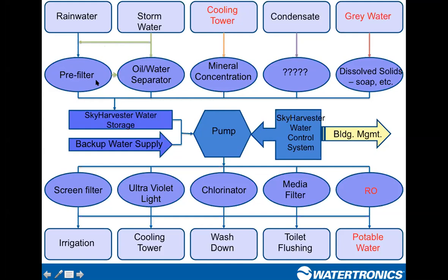Our first component is a pre-filter installed before the storage tank. You may have a different type of pre-filter — perhaps one that incorporates oil-water separation if you're collecting from a parking lot versus a hard-surface rooftop. The water then comes into the storage tank. We need to pump that water out, control the pump station, and determine if we need a backup water supply from another source — 99% of the time from the city — to handle irrigation in the event we don't have rainwater. Depending on the location and irrigation system type, we may also need a screen filter and disinfection.